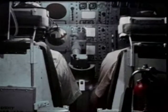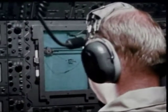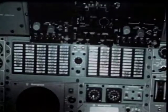The vehicle's effective search speed is 1 to 2 knots. The DSRV uses the planned navigation course, dive angle trim, speed, and active-passive location procedure. Refined information from the onboard sensors may change the original plan. Using its integrated navigation system and sonars, the DSRV navigates in relationship to the search target, fixed navigational points, or the mother sub. An onboard central processing computer integrates the data from sensors and controls, monitors all vital vehicle functions, and provides information to the operators.